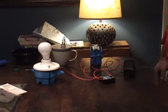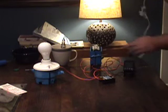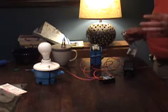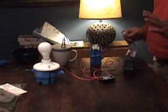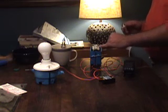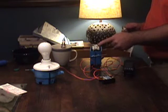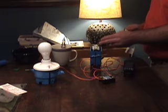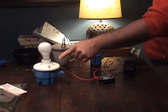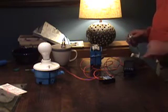What I did here is I wired in just a basic extension cord into a control box. I'm going to use very simple terms, probably not terms electricians or electrical engineers would use. Basically my lead wire goes in here — this is just a single pole switch — so my hot coming off when it's turned on, I have two leads coming off of it: one lead is going here to power my unit, the other lead is wired into the light bulb into the socket there.